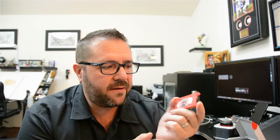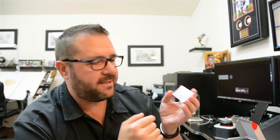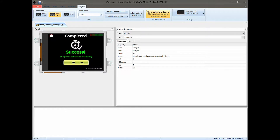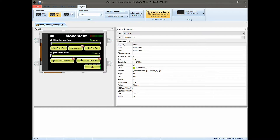This Picasso display is an intelligent device — it has a lot of resources and a processor built into the back. It has a micro SD card and a Picasso processor that interprets all interactions, displays controls, graphics, and components, making it a lot easier on the main processor. The processor really just has to listen for events — when a user clicks a button it raises an event and the processor reacts. It has a ribbon connector to a breakout board. They have their own tool called the 4D Systems Display Workshop to lay out screens, buttons, and graphics. The Workshop generates a file that goes on the SD card, making this a fully self-contained user interface.